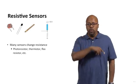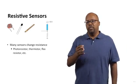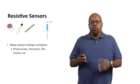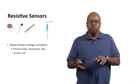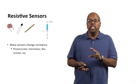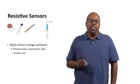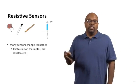If you remember from several lectures ago when I talked about potentiometers, I showed a voltage divider, and that circuit is exactly a voltage divider. A potentiometer has two terminals on the top and bottom, and a middle terminal between two resistors whose ratio can change. Similar things are happening here — the bottom resistor is constant, but the top resistor is this sensor, and that changes according to the brightness if it's a photoresistor, or the temperature if it's a thermistor.